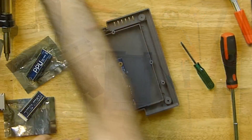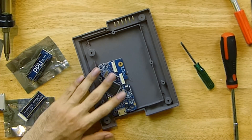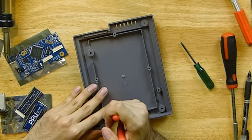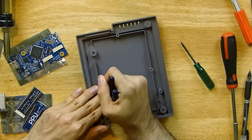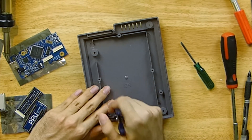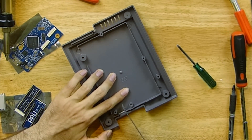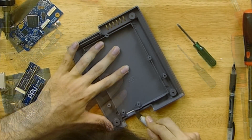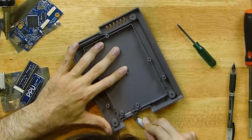Next is the painful part of cutting the hole into your system. The HDMI mod uses the composite mounting post to anchor onto the bottom. You'll need to cut out a section of the inner rib — it doesn't have to be perfect since this is inside. Just mark the area and snap it off. For the outside part, use your X-Acto knife.